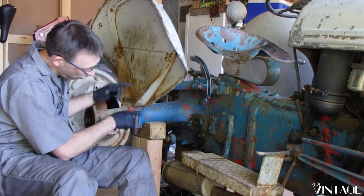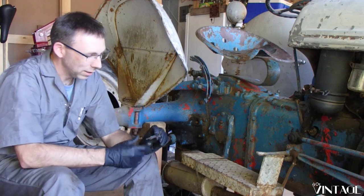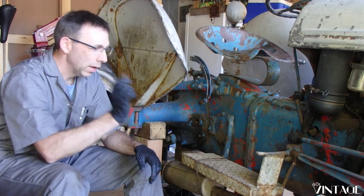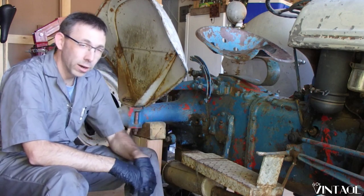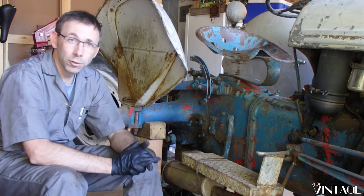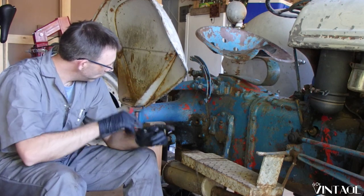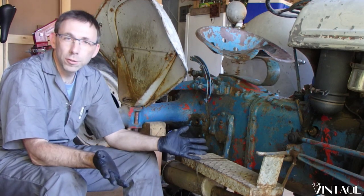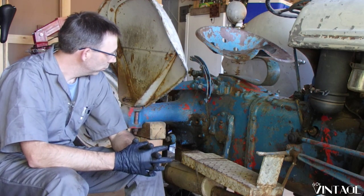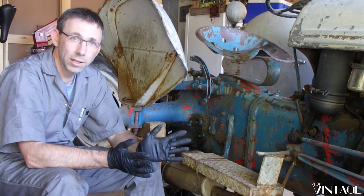We can scrape off, I can see a lot of this gasket material that was put in there. It looks like some sort of silicone, and we'll go ahead and scrape all that off, get a nice clean machine surface there, and I've got a brand new gasket that'll go on. We'll throw some silicone on it and put it on there, and squish that all back. Putting it all together. This is the perfect time to do this while we've got the axles out. Just makes it a lot easier since we're already in here. So we're going to go ahead and show you what that looks like.